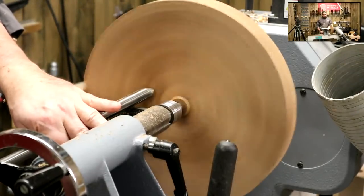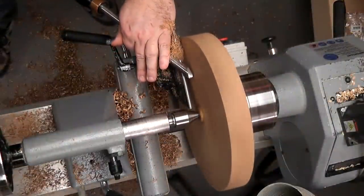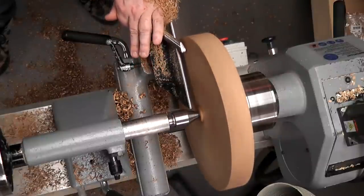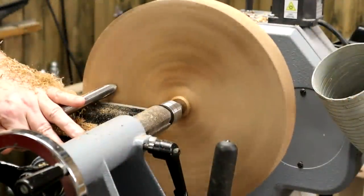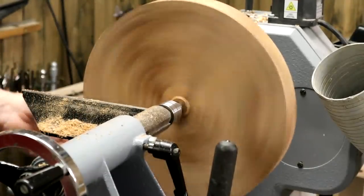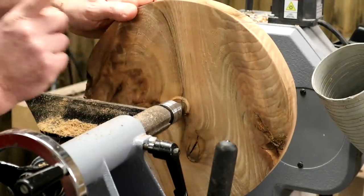You get shavings, which are referred to as angel hair shavings, because they're so light and wispy. The only thing here is there's no bevel rubbing, so your flat surface you have to guide rather than rely on the bevel. But that works really, really well, and that will minimize any of that tear out and take it right the way down.